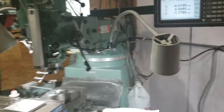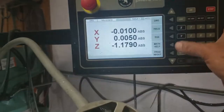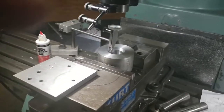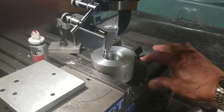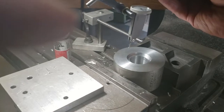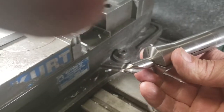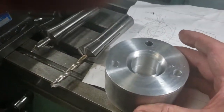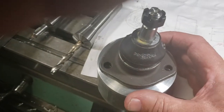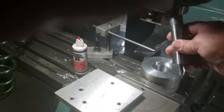I just set up the first operation on the CNC milling machine. It's a two-axis CNC knee mill, and what I'm doing is drilling three holes — one, two, three. I put the part in, put a V-block in the vise, tighten the vise. I have the part set up on parallels. I zeroed it in with my universal indicator holder and my indicator. I put in a combination center drill countersink, then drill through. I put the ball joint down on there — it has a nice fit. I drop the drill bit down through the holes to double-check and make sure the holes are right. Good to go for the second one.